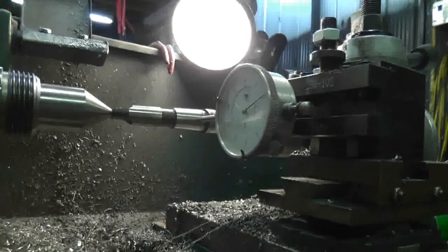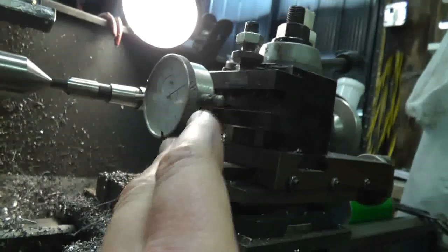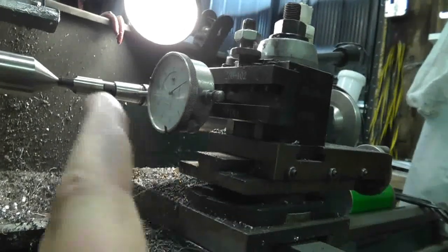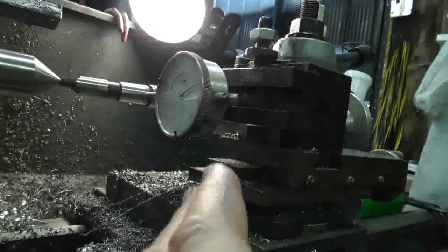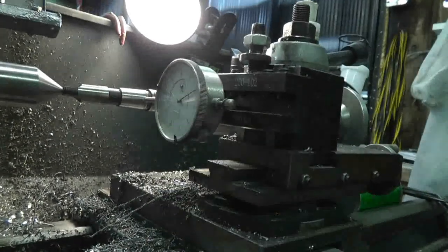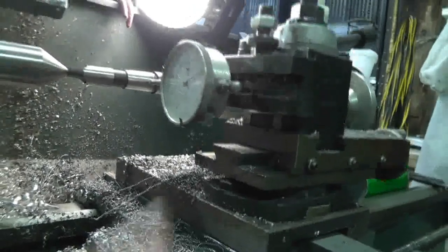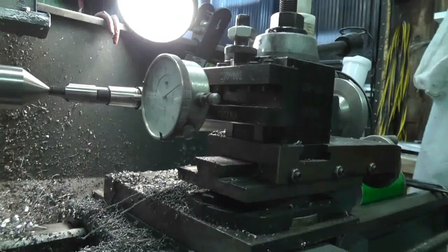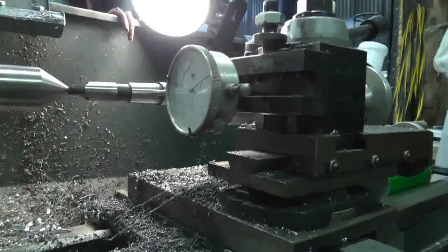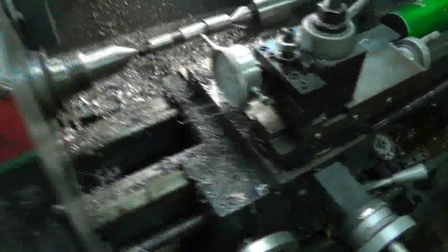One last word before I take this apart. To make sure the dial indicator was on the midpoint of the taper — the high point — I have an adjustable tool post, so I adjusted up and down until I saw the high point. Like finding top dead center on a piston, it's a little tricky because movement slows near the peak. You go past, then back up a similar amount, and narrow in on the exact high point by splitting the difference between the two values on either side. By the way, I am not an expert on this — this is just me trying it for the very first time.